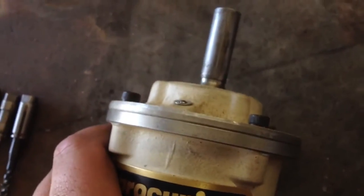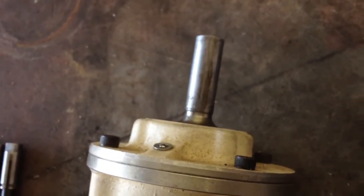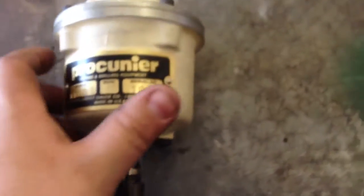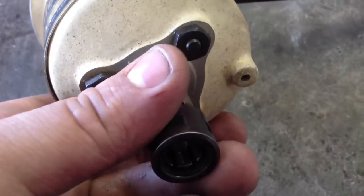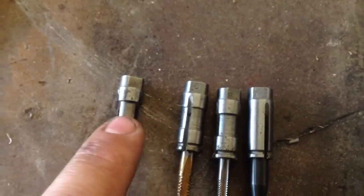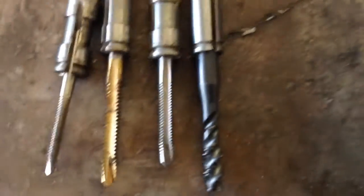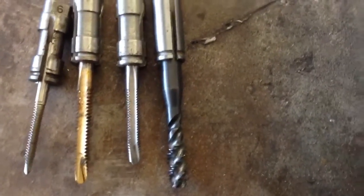The larger ones have like an M2 or M3 shank so that it can be put into a real mill. This is just a small one. And that's where the collets go into — you tighten that down on the collets. Every tapping size: this is a quarter inch, that's 8-32 or 8-whatever. And these are all gun taps — you can tell by the end, they shoot the chip up. The only spiral tap I have for this is a quarter-twenty, and that's if you've got a through hole. Those are good because it will spin your chips out and won't break taps.